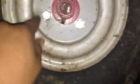But I did manage to get the front wheels mounted, so we got front wheels, at least. But I'll show you these snapper freaking hubs. They would have worked perfect, but I can't get the daggone things off. See these three bolts? It comes out like this much wider, and I could weld those into the hole like this in the giant wheel I'm going to be using. But I can't get the dang thing off. So what I'm planning on doing is just cutting the center out of a wheel and leaving the center part and welding this part into the center of this wheel. Just welding along here. So that way, put these suckers on the tractor. That's what we got.